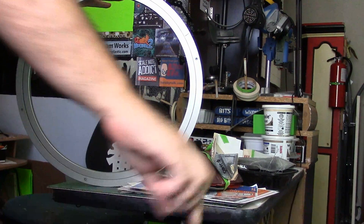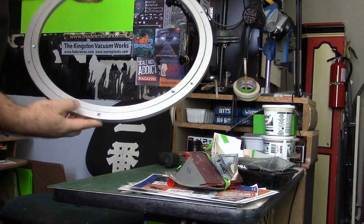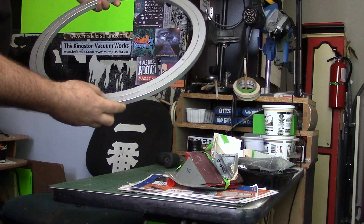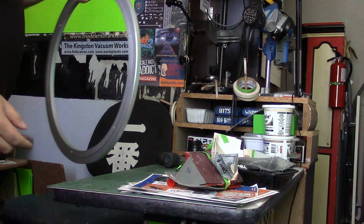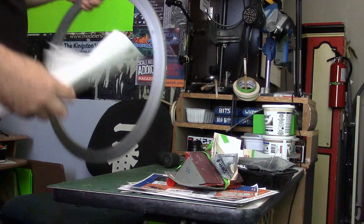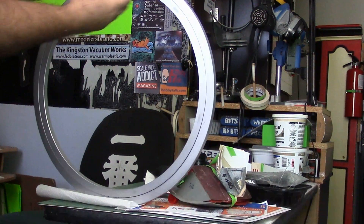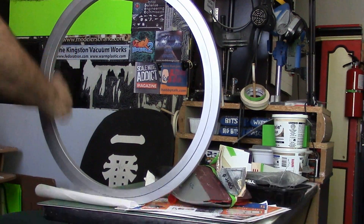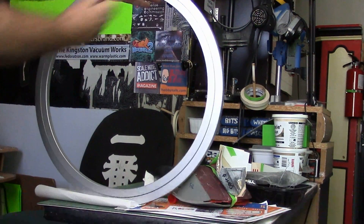All right, let me give this a few spins here. So it's binding — all of a sudden it just chokes up and it looks like it's pinching here and here. Over on this side it's here and here, but definitely some binding up in there too. Looks like I'm losing a lot of grease doing this. This is the first good amount of spinning I've given this thing. Once it binds it'll either free up immediately or there's a range that's binding and can be worked through after a few tries — essentially being worked around the system.